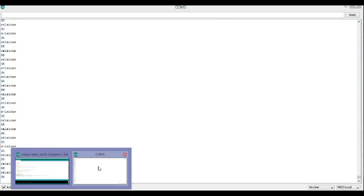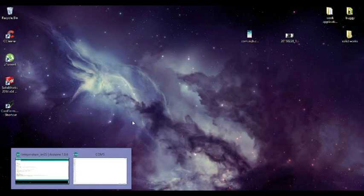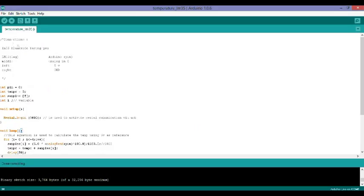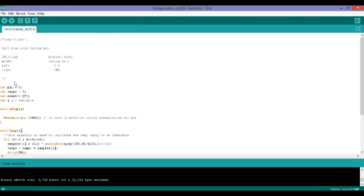As you can see right now I have it connected and it's measuring. At the top of the code you can see the connections. This is basically facing you the same way as the sensor — flat side with lettering facing you — so the middle pin goes to analog pin zero, the left is your 5 volts, and the right is your ground. That's how it should be connected.